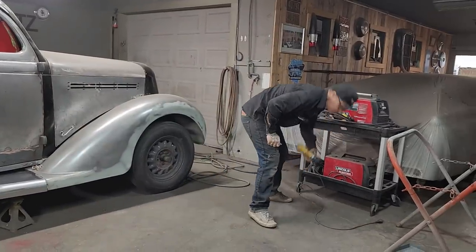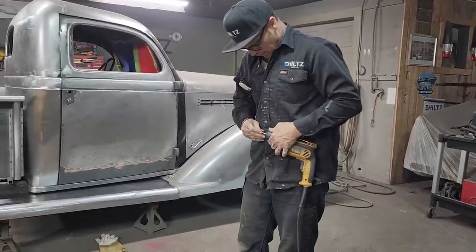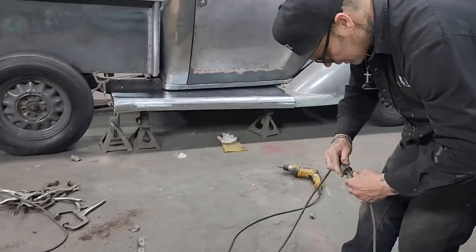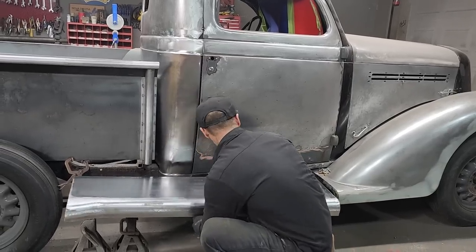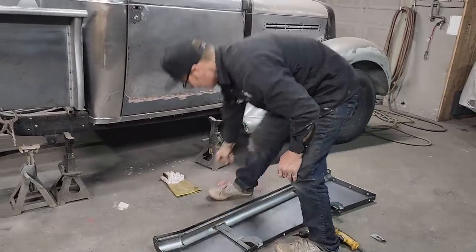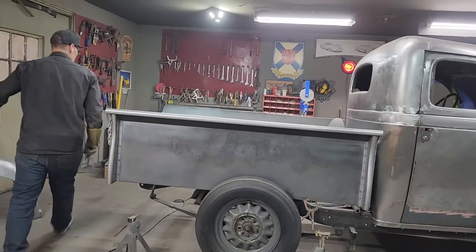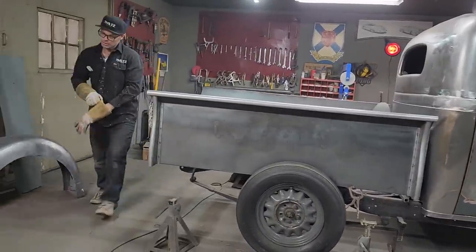I put them braces on that running board, and the holes were a little bit smaller than what I have, so I've made all the holes just a little bit bigger for adjustment, and that means I have room to play a little bit when I'm doing this adjustment. Nowadays, they don't have any adjustment, and the car can be built faster. If you've ever tried to put a car together with shims and adjustment, it takes a while. If you put the bolt in, you bolt the fender on, it's done. It doesn't take as long. Things with adjustment take longer to put together. Things with no adjustment are a lot quicker.